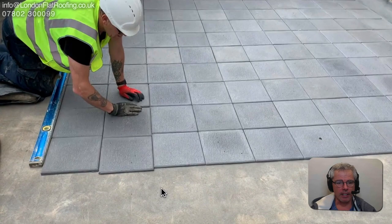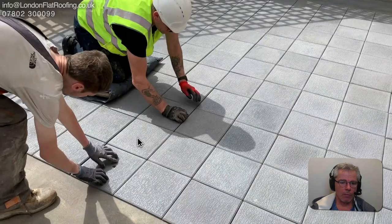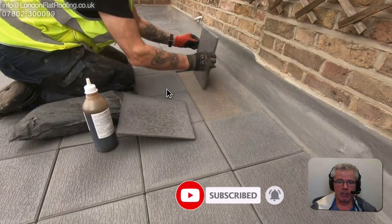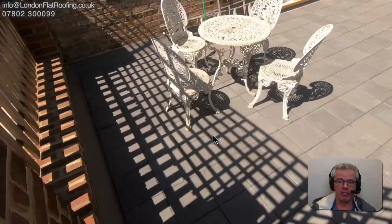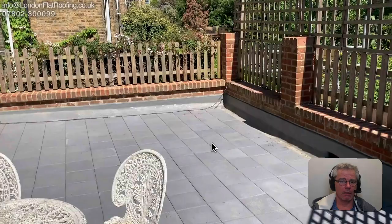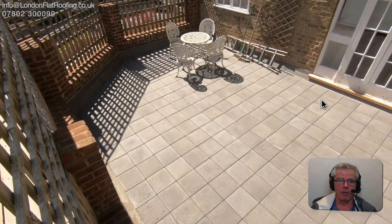Laying out the tiles is something we've found in the past not difficult, but you have to do each one individually. They're going around sorting out the ones which are slightly wonky from manufacturing problems, and some might have dirt on them. The glue expands so we mustn't get it too close to the edges - you can see them making sure it was central. Each tile is put down individually and here you can see this is a fantastic finish.